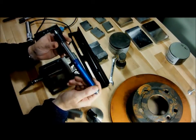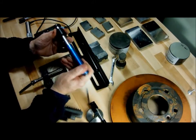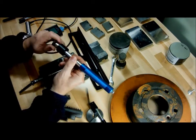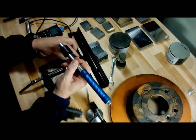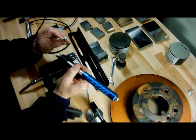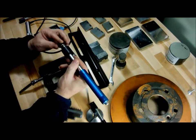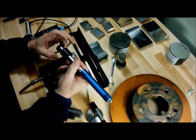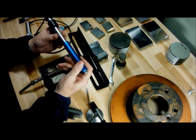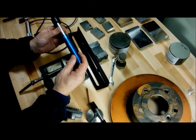Next is the G type — obviously much larger than the D, with a much larger firing force against the material. It's more ruggedized because it tends to be used in harsher environments, and it has a huge test probe with a much bigger carbide ball. This one is designed for very large heavy parts that perhaps don't need the same machined finish as other types. So for castings and very porous materials — but it doesn't measure in Rockwell C and all scales; it's typically only used in Brinell. This one fits to the other units just by plugging in the cable.